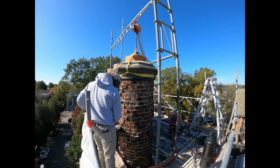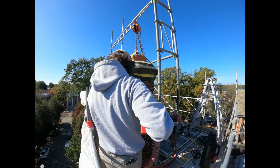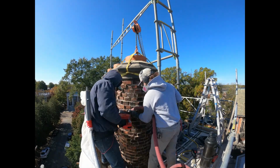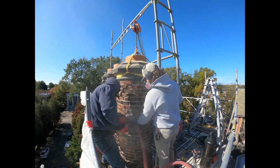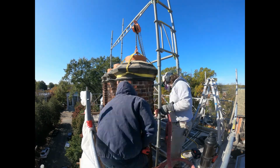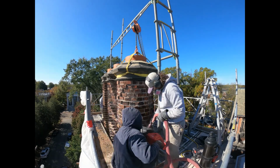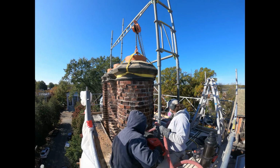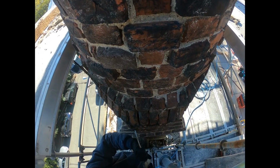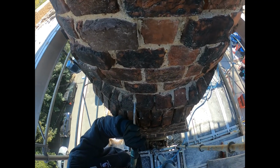In many cases, a structural fracture can be repaired by only resetting the bricks and repointing the mortar joints in a way that stitches the masonry on both sides of the crack back together, but these chimneys have a unique spiral design which required the use of narrow headers to maintain the curve of the chimney. The use of these headers reduces the length of overlapped surfaces as each course of brick is laid above it. This, combined with the iconic and historic significance of these chimneys as part of the Richmond skyline, helped make the decision that their long-term preservation was better served with a full restoration.